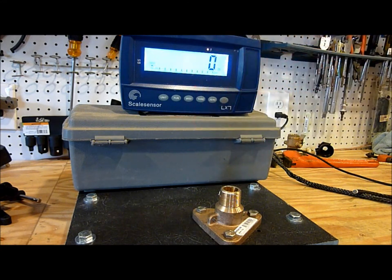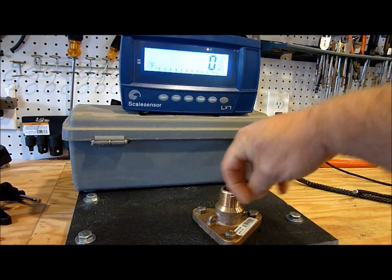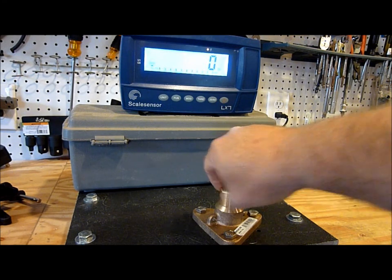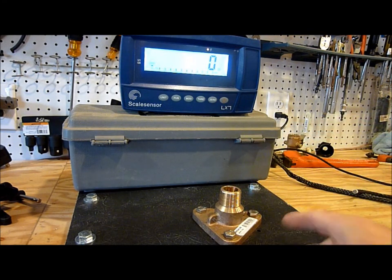When I watch the video again, we'll be able to see roughly where she held at. But I couldn't get it to hold any more than roughly 200 pounds for the 30 seconds that ABYC would require. And that's 300 pounds less than is required for a seacock.